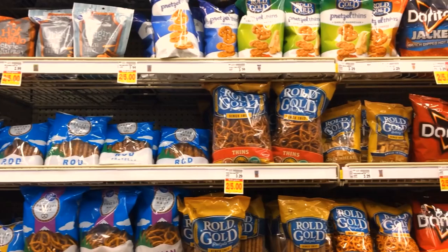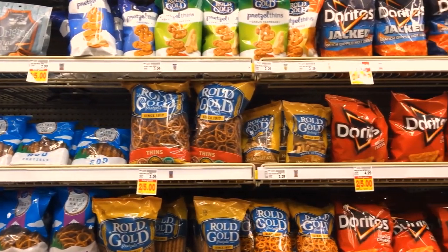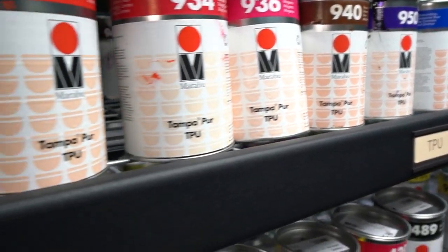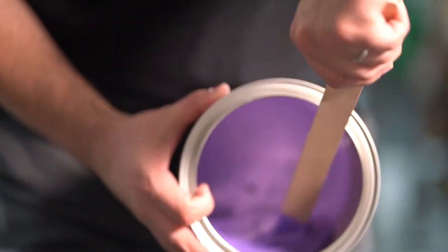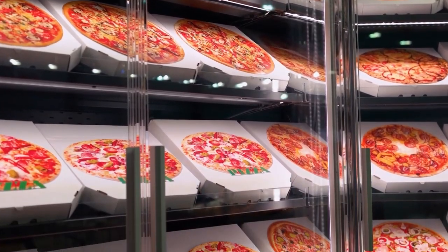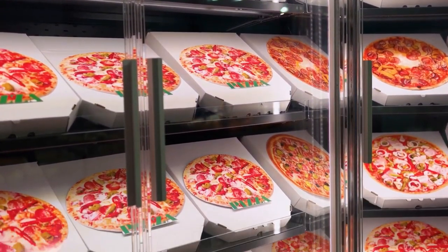Migration is another topic. If you're printing on food packaging, many materials that are used in food packaging are permeable by chemicals. So you can't necessarily print any UV ink on a material that's going to come in contact with food. You have to make sure that there will be no migration or chemical migration of monomers into the surface of the food.